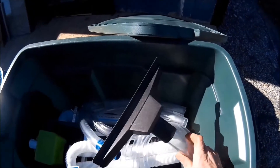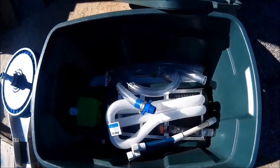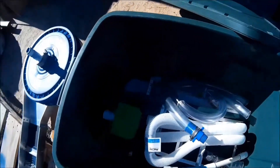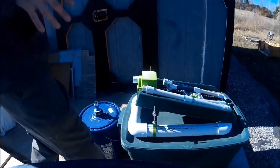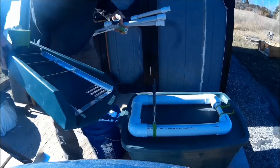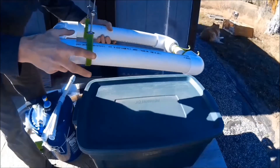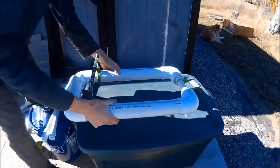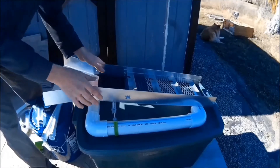I was actually going to use that like a flare at the end of a sluice. Here's my flotation device for the little battery-powered dredge. The platform is kind of cool because I just made this out of two-inch PVC with some little homebrewed hardware. You can raise the back and adjust those, hook it into the end of your sluice, get the angle right. Seems to float pretty good.